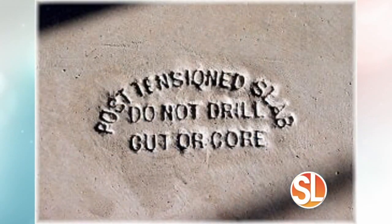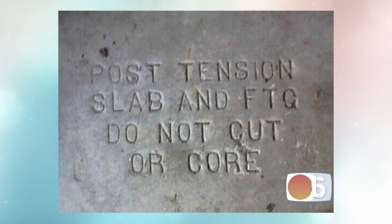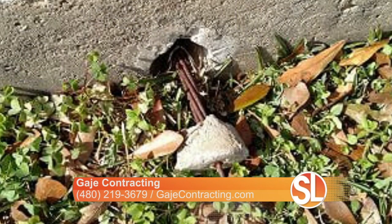It's basically just a different way of putting a house up — a different type of form. How do we know if we have a post-tension slab? Most people with a post-tension slab will find it stamped in their garage. Older ones may not have any stamp, so there are several telltales to look for — the front porch and back patios are actually part of that system, with no isolation joint between them. You may also see some corrosion around a couple of nail holes about so far apart with a little cup in between starting to corrode out.